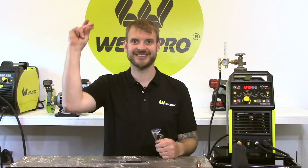Leather jackets are typically preferred by people who are running stick, flux core, MIG. Those types of processes emit lots of sparks and slag. Those sparks will quickly burn through a shirt. For TIG welding, I prefer a heavy-duty long-sleeve cotton shirt. Ideally, when you're running TIG, you shouldn't have any sparks spraying around. So without further ado, let me get changed and we'll get to welding.